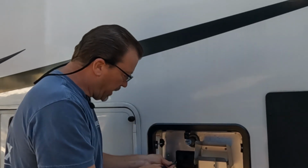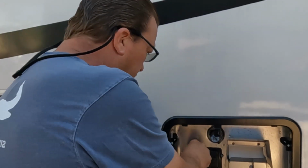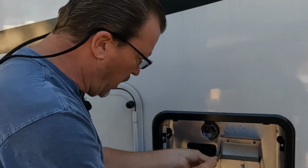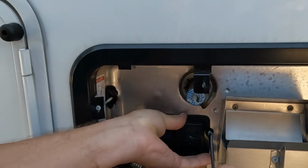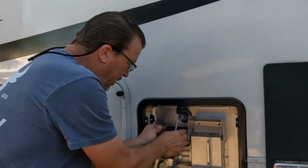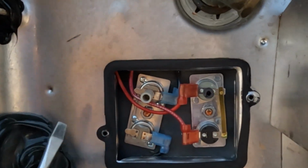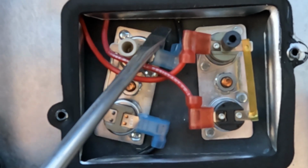So now I'm not going to mind my own business, but I'm going to be opening another compartment. A lot of times when they throw these together, the wires that are installed in here will actually be chafed. That's how they put them so fast together. So you take those apart, you take those screws apart, you go behind this. This is a reset button, and see, like this one, you'll be able to see the wires. They'll actually be touching the back end of this wall. So a lot of time what happens is, because you can see the wire chafing on the metal right up there, it will actually chafe the wire and will create a short.